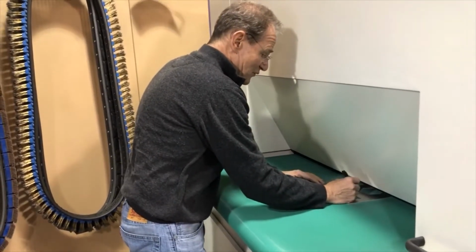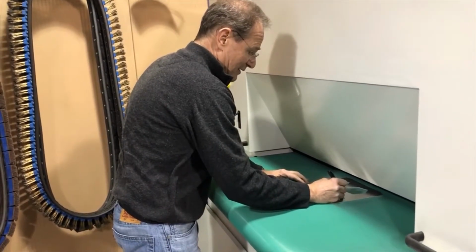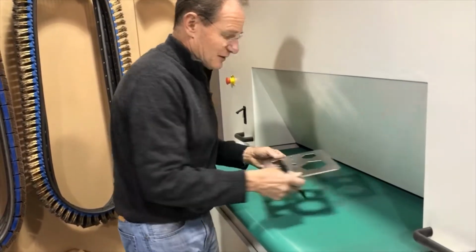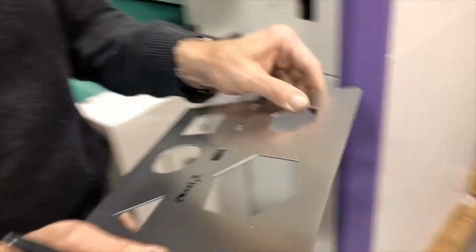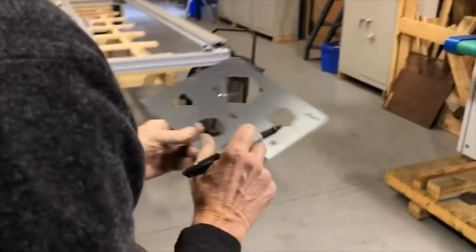So that's 2 feet per minute. And I did that because this was a dross side. We had a little bit of a dross side. Now these edges are really nice. And also it does a little bit more on the surface. And then on this side we're going to go to 4 feet.